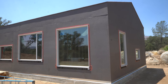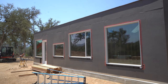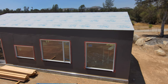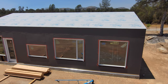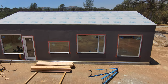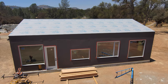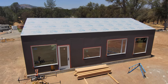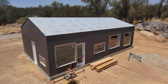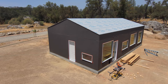You might be thinking it seems like a lot of effort for all that waterproofing — isn't it usually pretty dry in California? Normally yes, but we do get quite a bit of rain in the winter, and as you can see there are no eaves on this house, so there's no overhang. We have to treat the walls a lot like a roof because any rain coming even slightly sideways will get the walls pretty wet. So just taking a few extra steps on the waterproofing. We've been working on this project for four months now, and we've started some framing inside. Stay tuned — we'll see you next time.